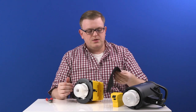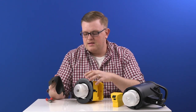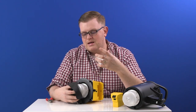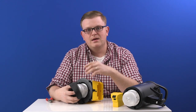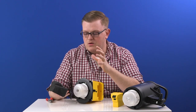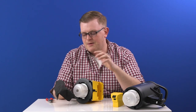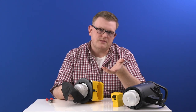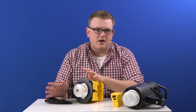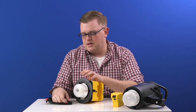Next, you will want to use either rubber gloves or some kind of microfiber cloth. The reason for that is you don't want the oils from your skin getting on the new flash tube, because these emit a lot of energy and a lot of heat. The oils can actually cause the flash tube to blow. I'm going to use a microfiber cloth in this case, but I typically use rubber gloves. And finally, if it does break and you have broken glass, just be careful — you don't want to cut yourself, so always wear gloves or use any tools you need to get the flash tube out.